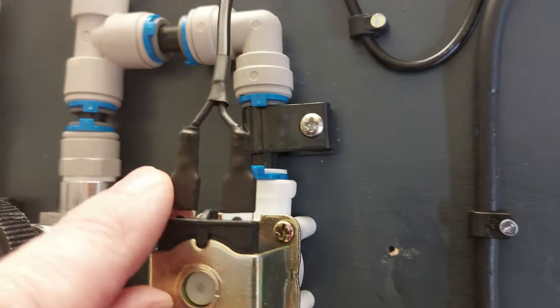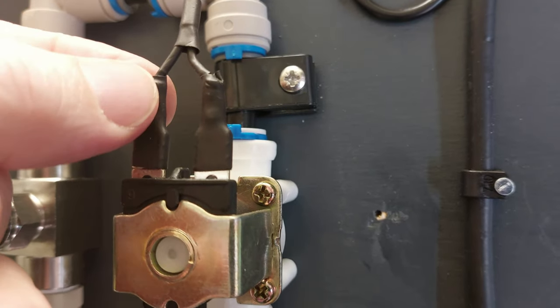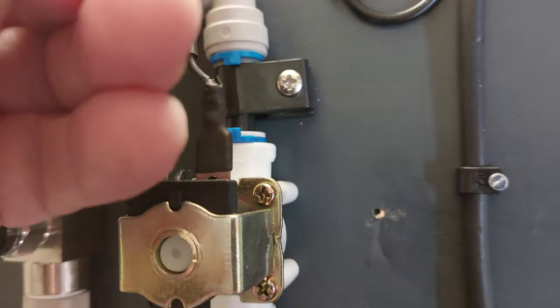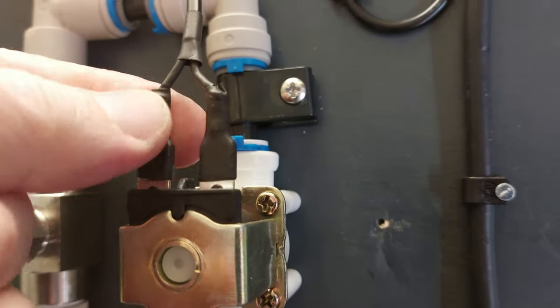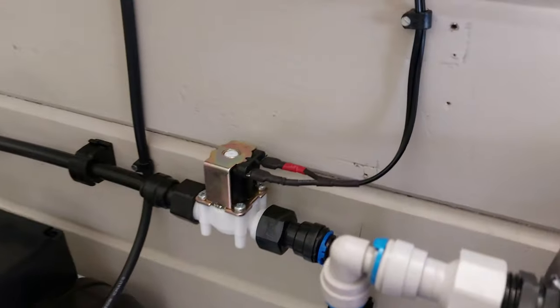As you can see there, heat shrink tube that was crimped onto a 6.3mm spade connector, soldered the connection inside here, which is easy to do, then heat shrink over there, and then a little bit of heat shrink cable over the two there, just to keep it nice and tight and secure, so there's no chance of these things coming loose and having any problems with them.